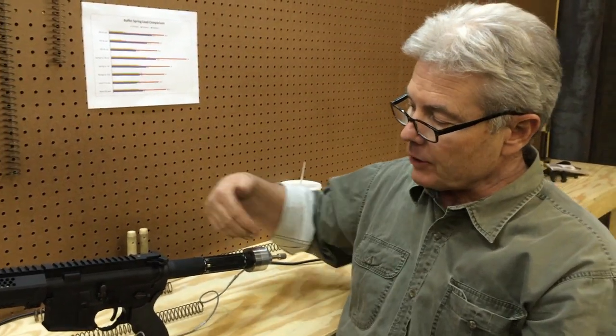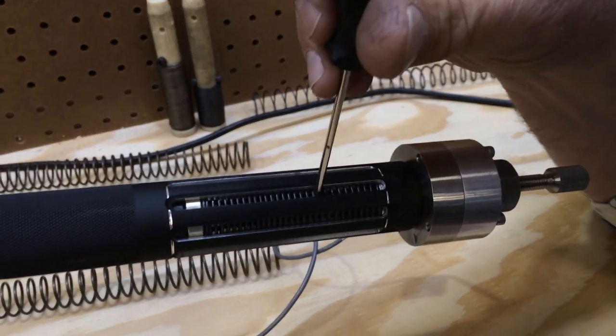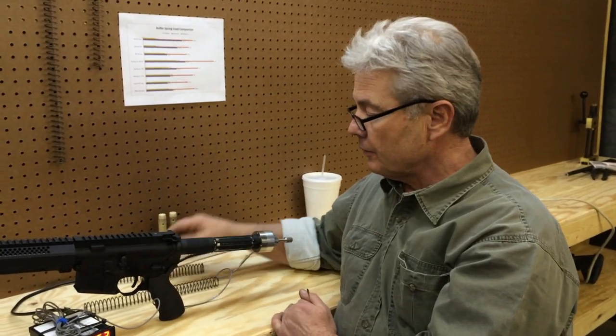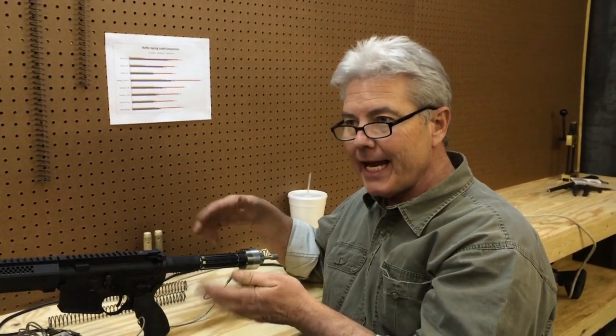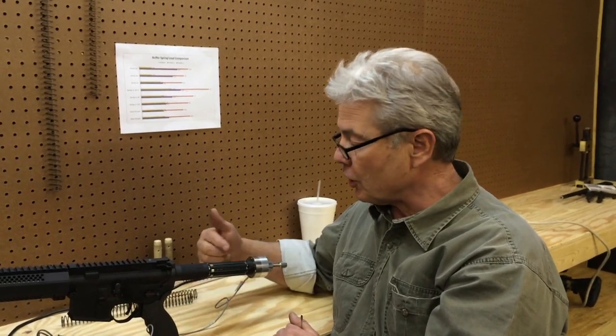So what I've got is the ability to retard the bolt coming to the rear by 20% more, which is going to make my gun more reliable and function better. Not to mention, if you look at the gaps here — I can stick a screwdriver through those holes and not touch anything. So you think that spring is going to take a set? Not nearly like a round wire spring. This spring is probably good for somewhere between a half million and a million cycles. This is a coated flat wire spring.